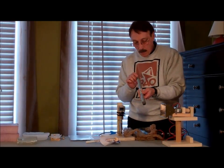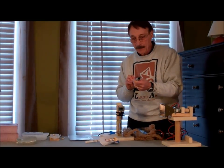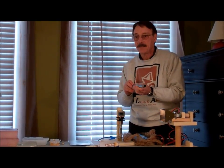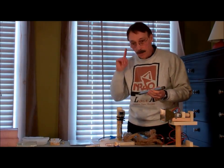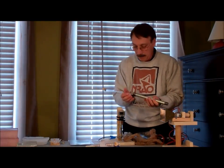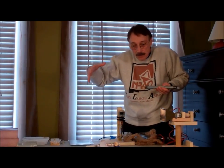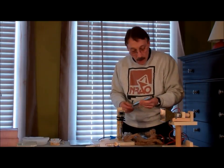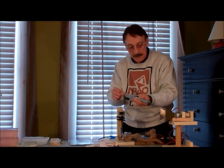Now remember, our wavelength is 3 centimeters. This will not allow a wavelength of that size to pass through. Now if you think about it, if we only have this size pipe, is there a way of allowing that to pass through? The answer is yes. Remember what we learned before about lenses. If we take our polyrod and shove it in the tube, we now have something that behaves like something that's much wider. And we get a lot of signal. Okay, so if you're stuck with something, you just fill it with the right material and you get something that passes radiation through.